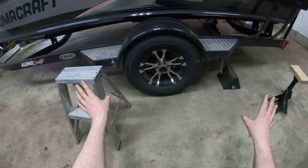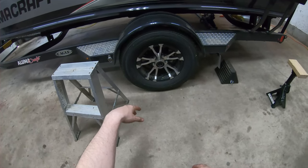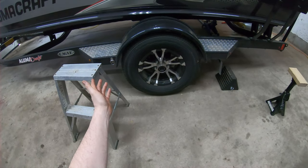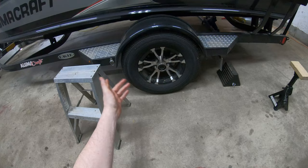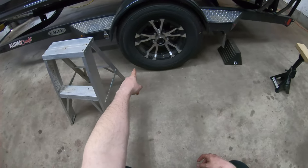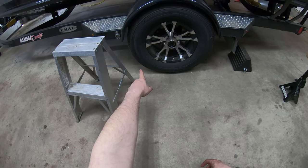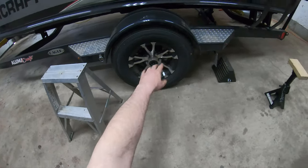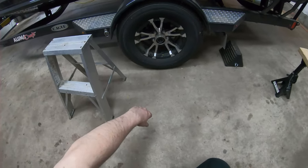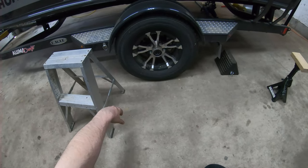They always put the cheapest crap on and then you kind of have to upgrade it as time goes. So I made the mistake of, you know, 65 mile an hour. I mean, you can get up to 70 or 75 sometimes when you're dragging your trailer. These are good for, I believe, 87 miles an hour now. These are the Goodyear Endurance. Way thicker sidewall, way better quality. They aren't the cheapest things out there, but I'm not going through a blowout again.